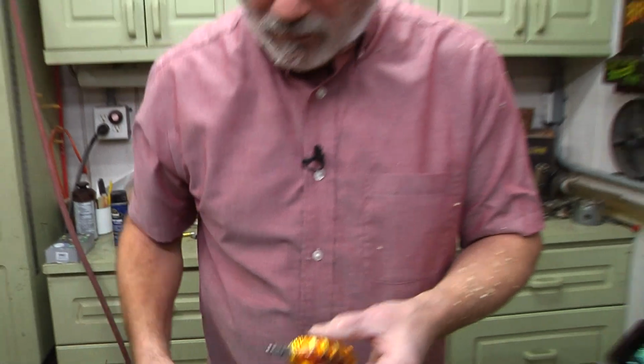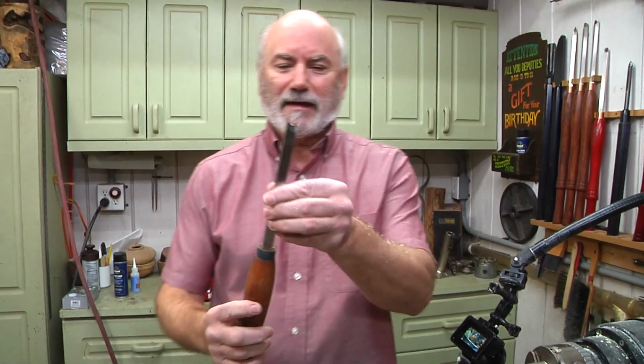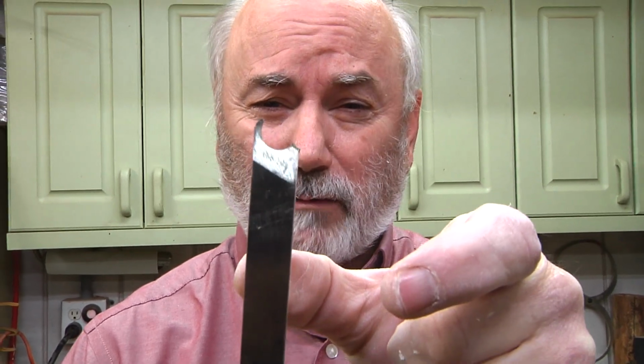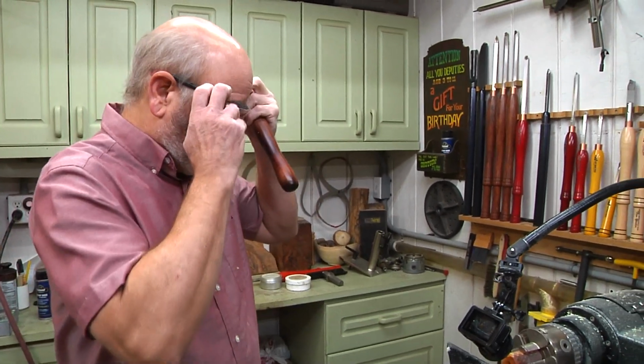Really cool. So how am I going to make the groove for the O-ring? We're going to use a captive ring tool. So this little doohickey here is how you make those little rings that go on the base of a wine goblet or something so they rattle around. It's really cool, but also makes the groove we need for that O-ring. So let's fire this up.